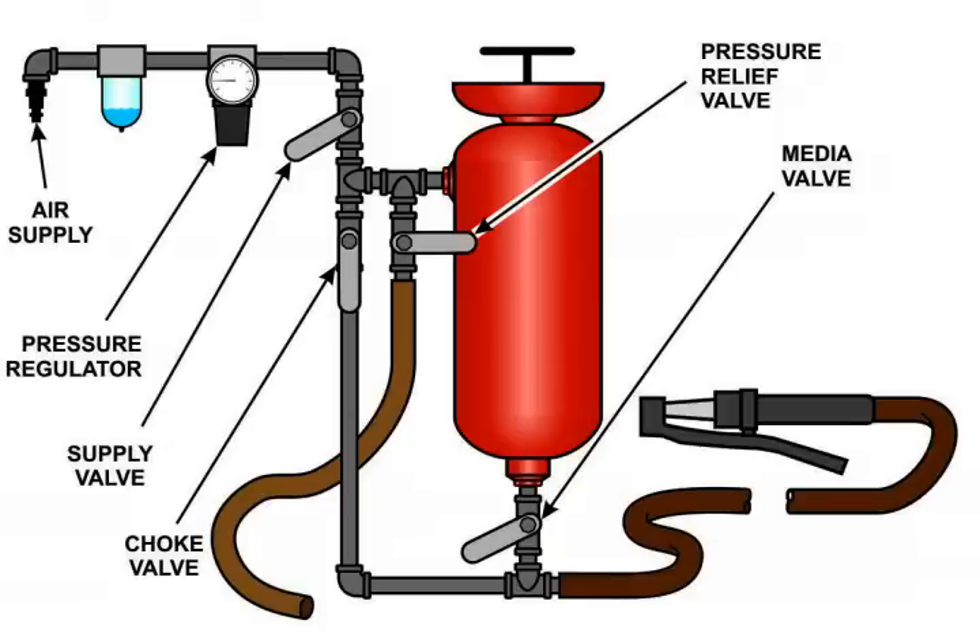As you slowly open the valve you will see media exiting the nozzle. Too little media will be an intermittent flow that is useless for blasting. Too much flow will flood the line with media, causing burping, which is at best annoying and a waste of air. For most work you will want to sneak up on the right flow, which is slightly beyond the point where the nozzle sounds like a spitting cat. The most useful will be a steady hissing sound with a steady flow of media. You can have this hissing while still flowing too much media, so the best method of adjustment is adding media until it is functioning properly and stopping there.